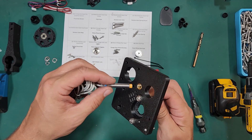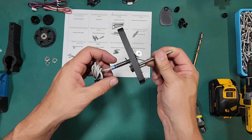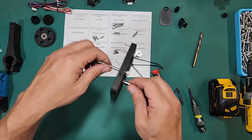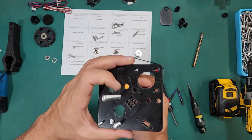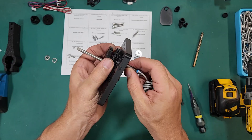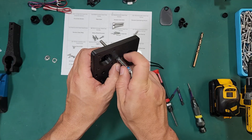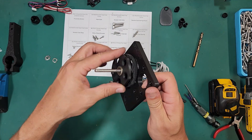Now we're going to install our proximity sensor. I'm going to quickly thread this on and make sure everything is still level and flush — if not I can add a little more heat and straighten things out, but it looks good. I need to add one of the lock nuts on here. We're going to thread this in until it's flush with the top of the base. We don't want it protruding above the top, and we don't want it too low or it won't pick up the brass as it falls. Screw it into place, put some pressure on it with the feed wheel to make sure it's not catching, thread it up until it catches, then back it out until it's not catching anymore. Lock down the screw with needle nose pliers, and do one last check to make sure it isn't sticking up.